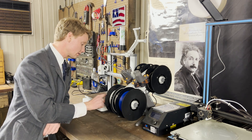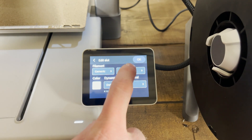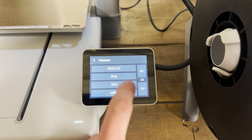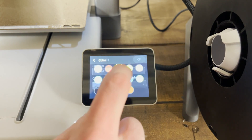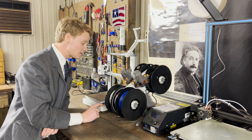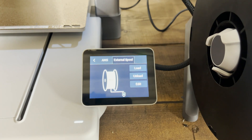Click Edit. For Filament, select Generic and where it says PLA, change it — scroll down to TPU. I'm going to make the color of mine yellow, even though it's black, so I don't mistakenly choose the black TPU over the black PLA. Then click Load.